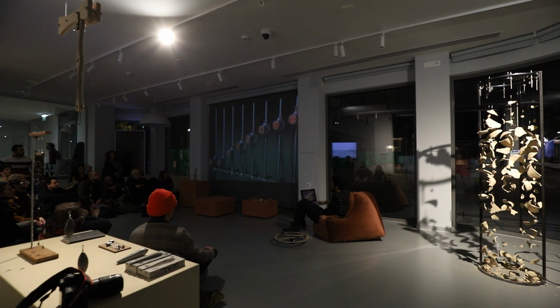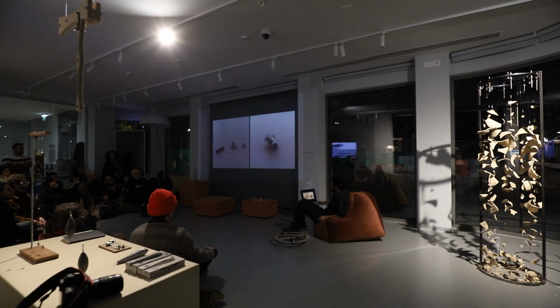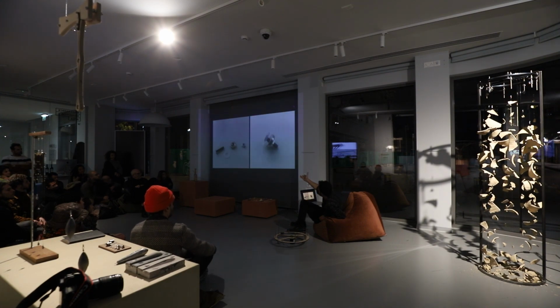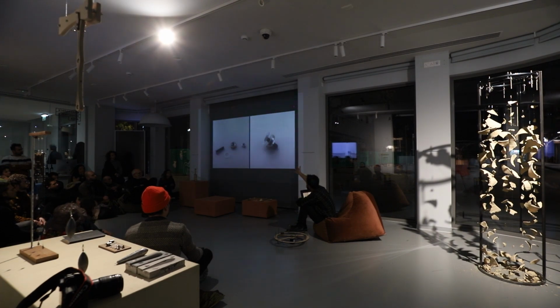These electromagnets are really the heart of these instruments. I make these myself, and it's usually a quite painful process because you have to really make everything yourself. This is one of the big ones, and this is one of the smaller ones. And this one, if you just look at this thing, it's just a bolt with a shaved head. You can see that on the left. And then I place a small 3D printed plastic to create the face of the electromagnet. And then there's a permanent magnet, and then that goes back.